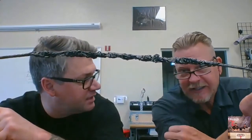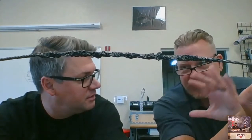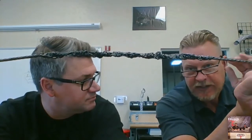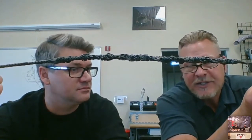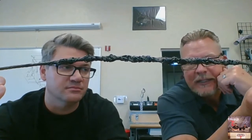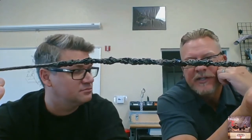This is the core section. On both sides it should look normal, but this one actually didn't break. There was no external damage to the rope — the outer strands looked perfectly fine. However, we did a non-destructive test and noticed an anomaly — it looked like a snake that had swallowed a rat. We were able to get this piece of rope sent back and dissected it. We talked to rope engineers about this. They said: imagine a bungee cord — if you pull it apart and let go, it kind of pulls together. Steel does the same exact thing, but it doesn't bounce back; it just springs together and stays there. They replaced a 1,700-foot piece of inch-and-a-quarter rope because of this, and it was only a few months old.